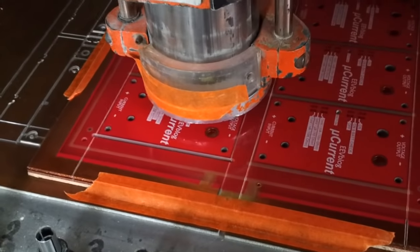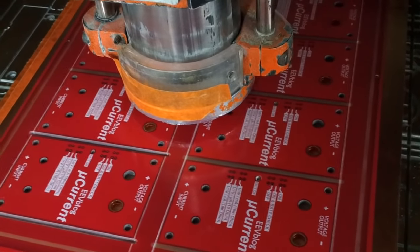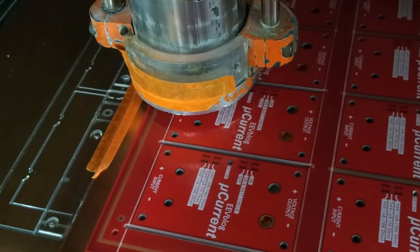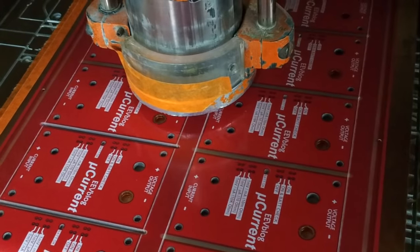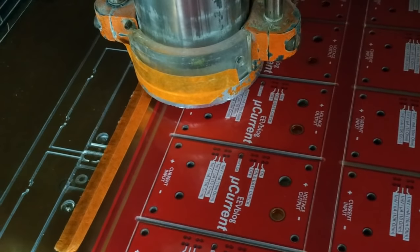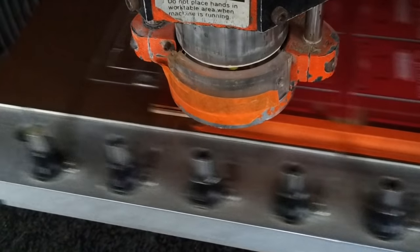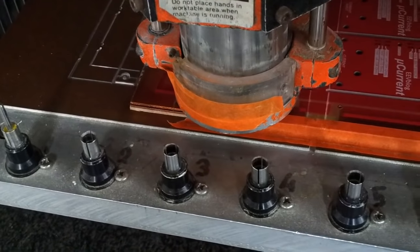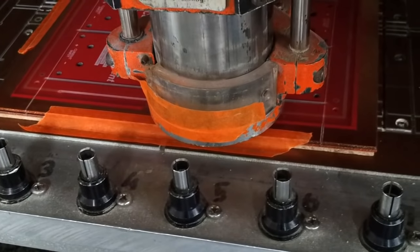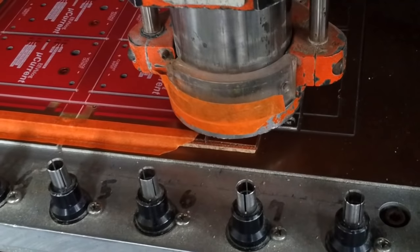You might have heard the change in the noise — it's changed to a routing bit now, doing the routes that I specified on the mechanical layer of my PCB. A typical routing bit size is 2.4 millimeters. My microcurrent board is a good example because you can see the V-scoring combined with the routing paths — I've got nice clean edges on the sides. The advantage of routing is that it provides really nice clean sharp edges, without fiberglass hanging out. I decided not to use what's called mouse bites — I've done videos on how to panelize, I'll link those below. There are various techniques for holding a PCB inside a panel, and I've decided to mix V-groove and routing here.